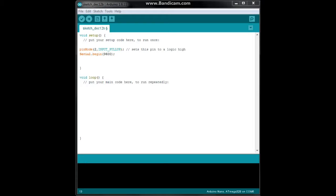The interrupt checks that pin every clock cycle, no matter what is going on in your loop — no matter what code is running. The way we do that is with attachInterrupt(), which we put up in our setup. That's a function and it requires three things: it needs to know what interrupt we're talking about. The Uno and Nano have two hardware interrupts — interrupt 0 and interrupt 1 — attached to digital pins 2 and 3. We're hooked to digital 2, so that is interrupt 0.